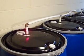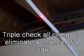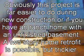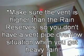You'll notice piping on the top of each tank — this piping is used for a vent. As you drain water out of the system, the air needs to go in, and as you put water in the system, the air needs to go out. This pipe goes up to the top of the stairwell, and you need to make sure that the top of this pipe is higher than your rain reserve. As the system fills up, the water will accumulate up here. The rain reserve will overflow the water back into the gutters if the system fills up completely.